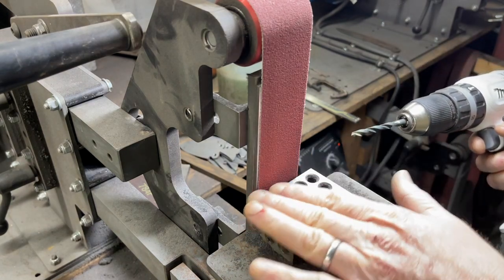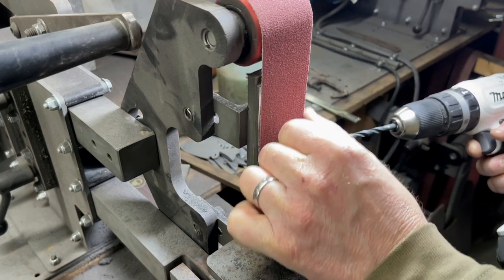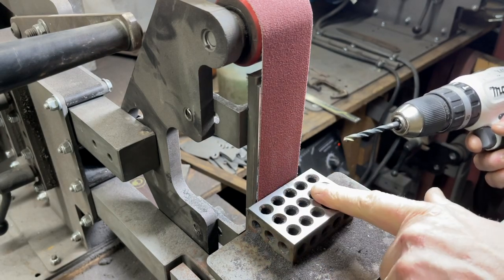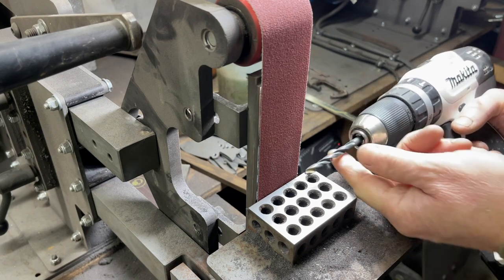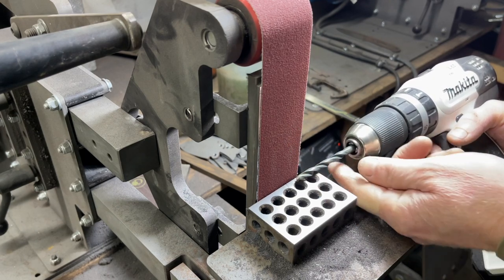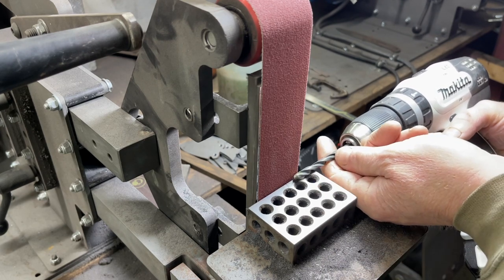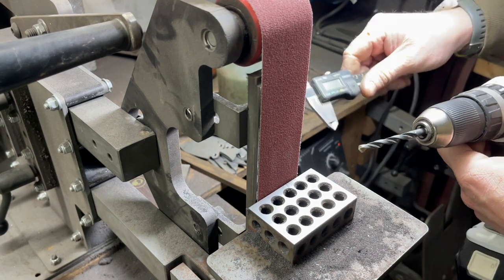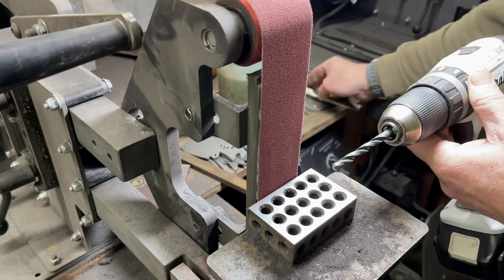We've come through to the grinding room. The tool rest is set up with a 120 grit belt that has a really nice sharp corner. I've put a 1-2-3 block on the tool rest to give a hard raised surface. I've fitted the drill bit into my cordless drill and I'm going to carefully run both the drill and grinder at the same time, touching the bit against the belt with it supported on the hardened 1-2-3 block. I'll slowly push into the belt removing steel, and keep measuring until the pilot measures approximately 4mm.